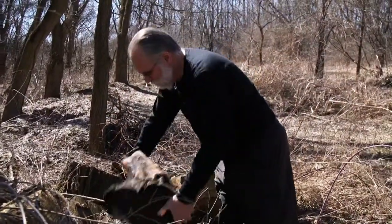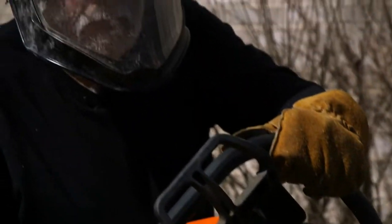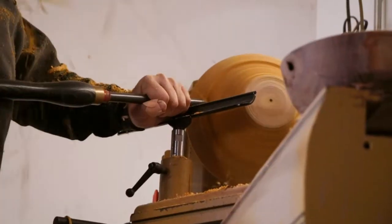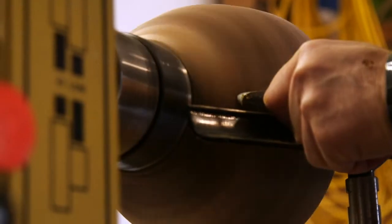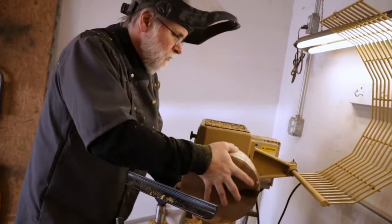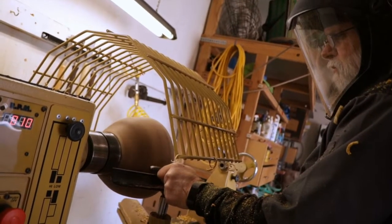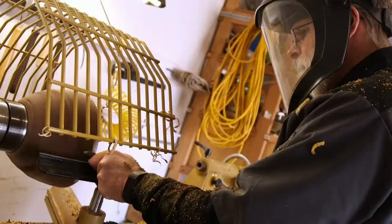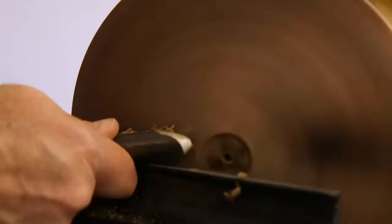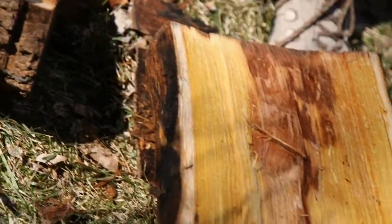Today you're going to see various stages — all the way from the raw material to getting chunks of wood into a shape that you can actually start to cut. We'll see some rough turning of the outside to get it to its rough shape, then some finish cutting. With every piece, it gets attached more than once: you attach it one direction, then turn it around to finish the other side. We'll also see an example of hollowing out. It won't be the same part throughout, because it can take up to weeks to create a piece — or if you're starting with wet wood, months, because you need to dry it out in between.